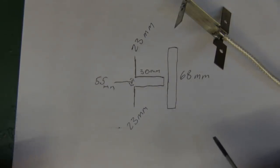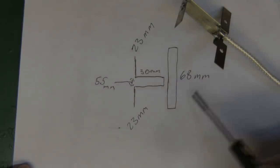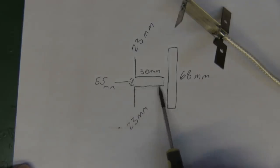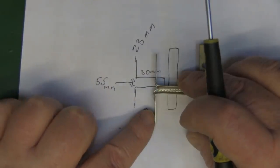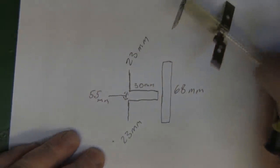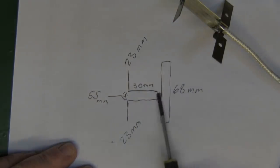If you've seen my previous videos covering the Hertzian dipole — why it's only 25 millimeters long instead of 31 millimeters — you'll know that the Hertzian dipole is capacitive, and a capacitive antenna is shorter while still staying on center frequency. I'm pretty certain this balun is having a capacitive effect on the overall driven element. They've made it shorter to stay on center frequency due to the capacitive effect of the balun, which is why we're not seeing 31 millimeters on each side.